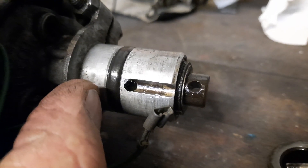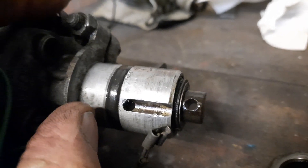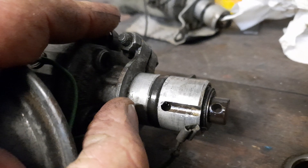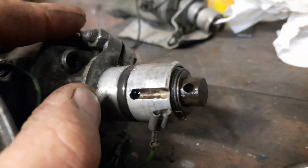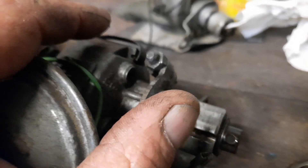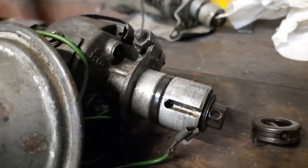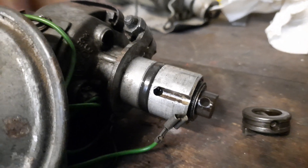There are little shims in here, and also some sort of a fibre washer in this one. I've taken the two shims out of that one, which still wasn't enough, and then I looked through my box of washers and found another shim that's the right size. So there should be no play in there whatsoever — when I put all the shims from the other one in, there was still about a mil of play, so we should be pretty close to zero now.